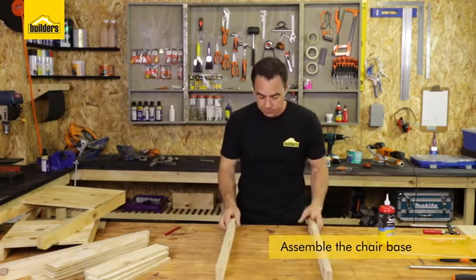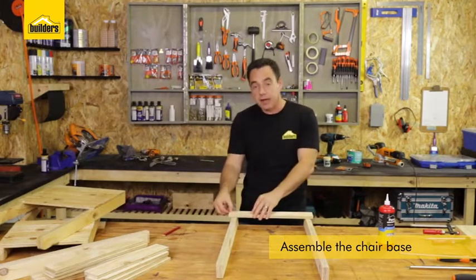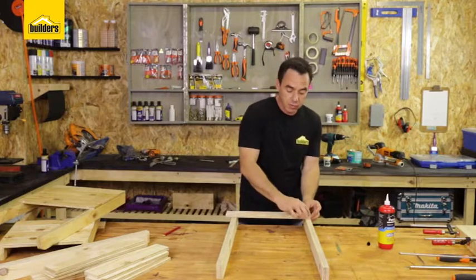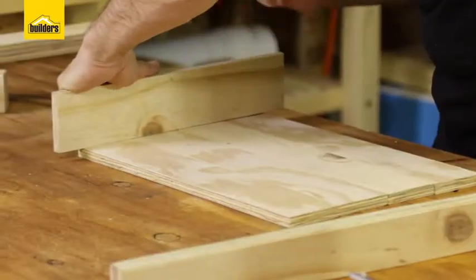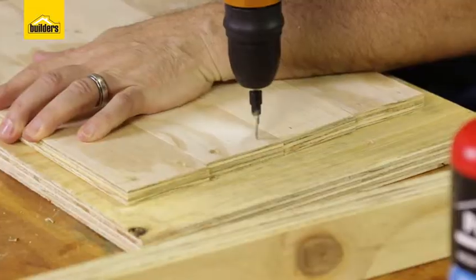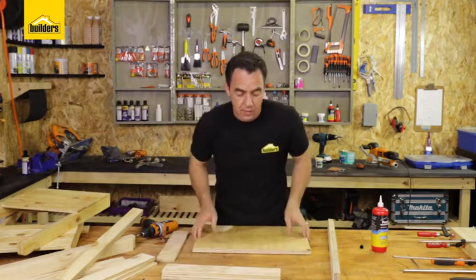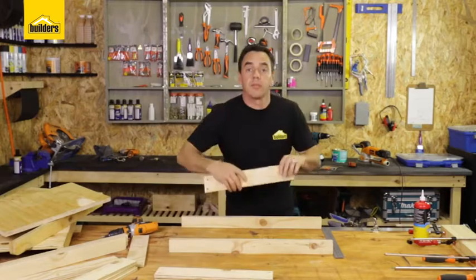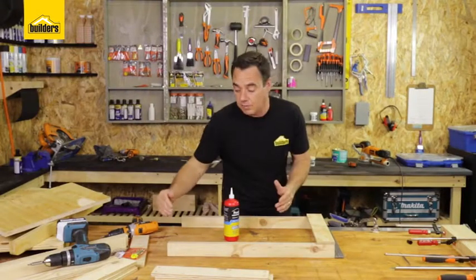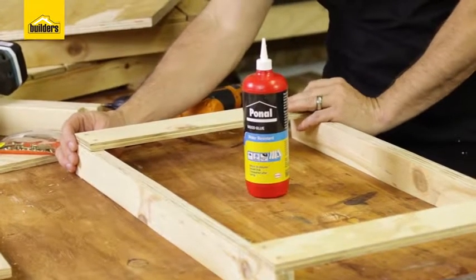Let's start off with our two uprights. We'll put those into place and then we're going to put our four slats all the way along. Now I'm going to pre-drill the slats first of all to show exactly where the drill holes are going to be. It's going to be in the middle of the slat and that's going to be 12 millimeters from the edge. My slats are 12 millimeters, so I'm going to use this as my marker. I'm going to drill my pilot holes — this bit has got a built-in countersink, so it can actually allow the screws to go below the surface of the timber. There are our four slats. Now we can actually start assembling our base section. It's a good idea to put wood glue in between the mating surfaces. To make sure I get the same spacing on the end and it's not tapering in, I'll just take another one and place it there so I know I've got it exactly right.